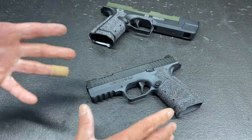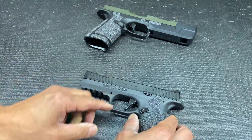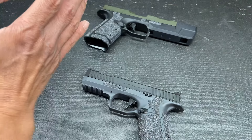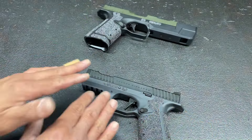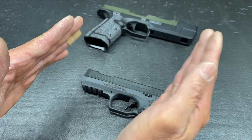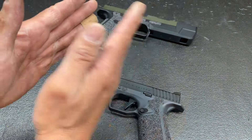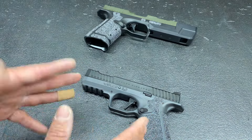And Range 6 is the combat trigger. All the parts inside — every piece of metal that's engaging metal — are nitride coated. When you're doing bullseye shooting or shooting for accuracy without a time limit, you get to do a really slow trigger press. You'll feel a lot of grit in any gun unless the internals are polished. So what we do is polish all the internals so that the trigger press is zero pounds on this gun all the way up to six — boom — and then it's over. It doesn't go three, four, and then get past some grit and trigger moves, or feel very inconsistent as you're going over those bumps of grit. All the parts that are mated up against each other during the trigger press and the trigger reset are polished.